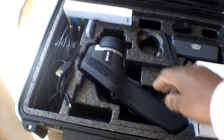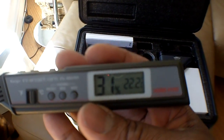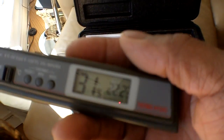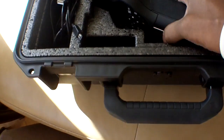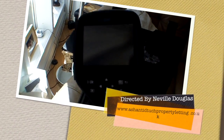This will cover 25 square metres. In this box we've also got a thermometer — it's already on and showing the humidity level as well. I'm going to record the humidity level, which is currently 31% humidity and 22 degrees — not too bad. I'm going to go inside, take a reading, then go outside and take another reading. Then I'm going to use this thermal camera and take a thermal reading. I'll show you the screen so you can see what the reading is going to be.